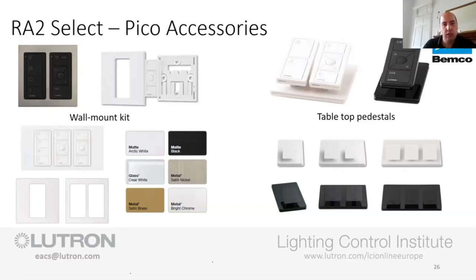the single and the dual one fits a 75x75 back box, whether it's metal, plastic or whatever else, or it can screw straight to the wall as well, so it doesn't need a back box. You see in the top of the picture for the exploded image where you've got a back plate and you can see the fixing holes. The good thing that we've done is we've done it top and bottom and left and right, so that if you go in a box with top and bottom lugs, you can fit it to it.